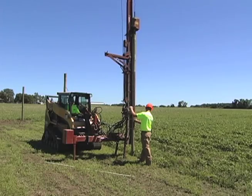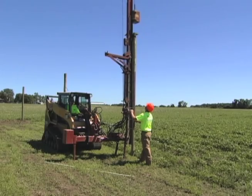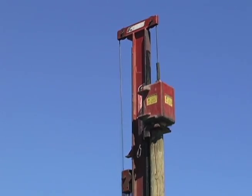As an alternative, you can hire a crew with post driving equipment to install the posts. The widest end of the post should be driven in and backfilling should be done around each post as needed.